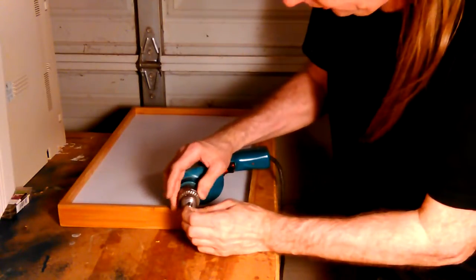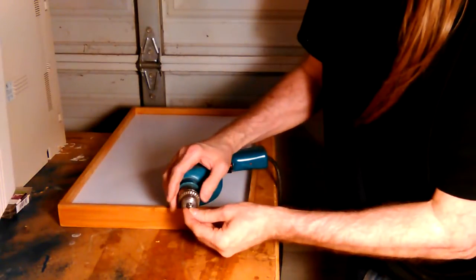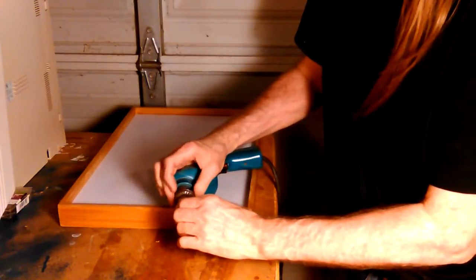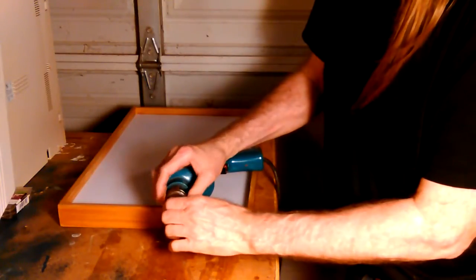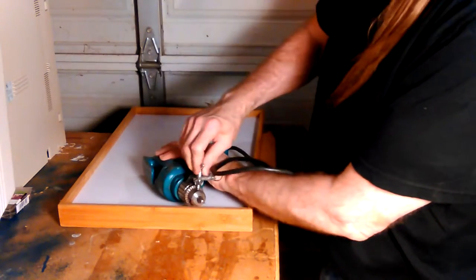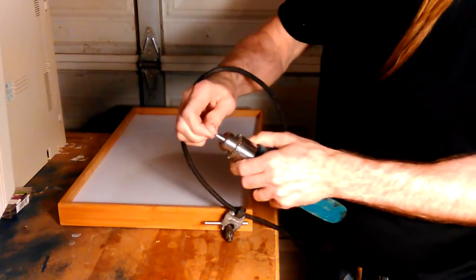There's a place in this chuck. Yeah, it'll chuck up. Well, no, maybe it won't. Let me put it in there the other way. You gotta have the pointed end out. No, I don't think this one will do it either. Yeah, maybe. Let me try using the chuck key on it. If they're just close but not quite, sometimes you can leave the head on them and get it to grab just the head, because the inside of that is kind of tapered. Yeah, that'll work. So I'll cut the head off. I'll just leave it there to do the cutting.